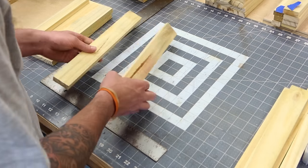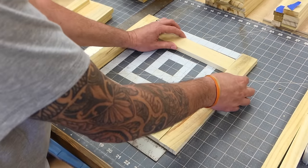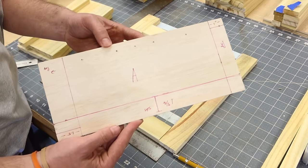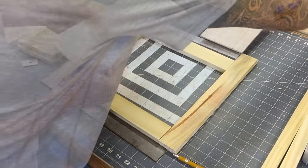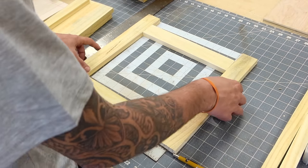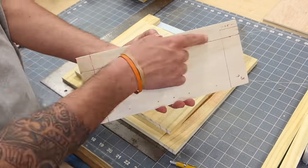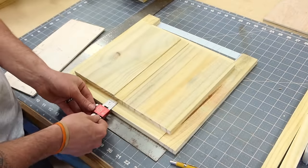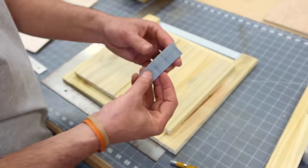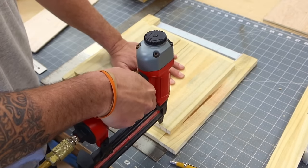I'm using an L square to keep everything square. I'm starting with an A panel, laying out the legs — they will be labeled Leg A in the description. I'm also using two cross boards A, measuring up an inch and a half from the bottom. I actually made jigs for this build, so I'll be giving you the spacing measurements as well as teaching you how to make the jig. On a scrap piece of quarter inch ply, I've already marked out an inch and a half since that's what the bottom spacing will be for every one of these panels.